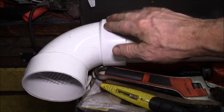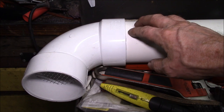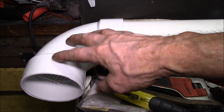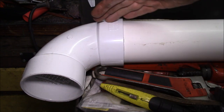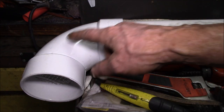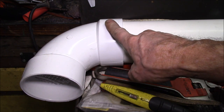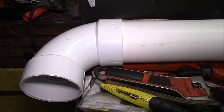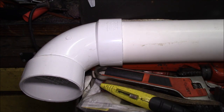That's something to consider if you're using three-inch PVC venting for a tankless water heater install — finding these fittings can be tricky. I also had to order the 22.5-degree elbows online. You really need to shop around because you can find them if you want to pay $10 to $12 per elbow, but if you want a reasonable price you're going to have to wait.